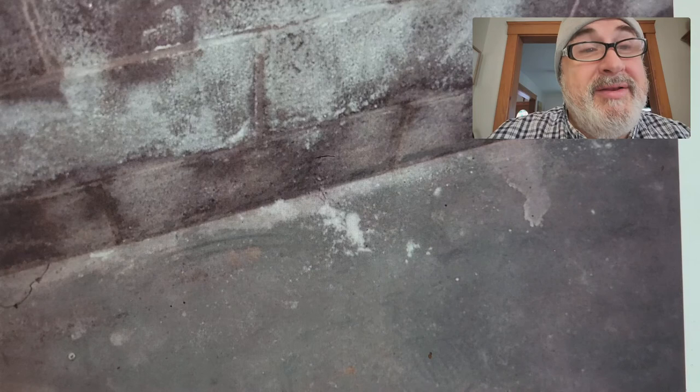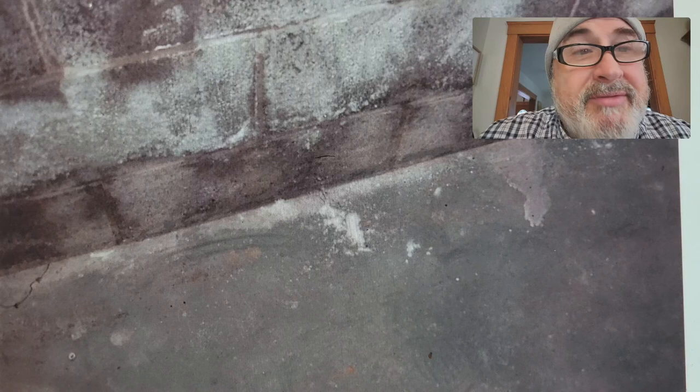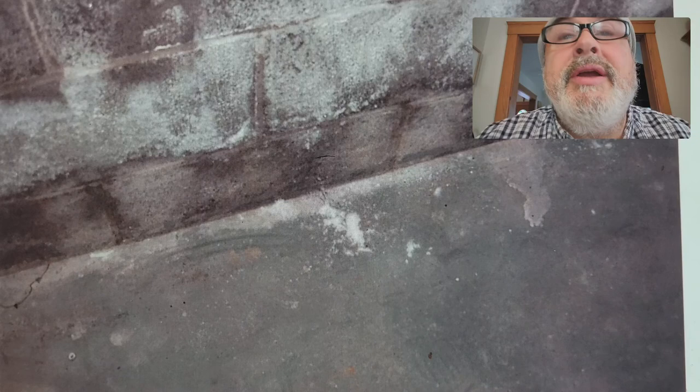But today we're going to show you what the growth looks like. When you see white on a foundation, it's efflorescence. How do you get white efflorescence? The salts leach out of the material because they're wet — or they could just be moist. It doesn't mean you're going to have a floody basement. A lot of new homes have efflorescence. At the mortar joint it's white, and maybe you could scrape it off. Running a dehumidifier helps, but if it leaks, it's a whole other issue.